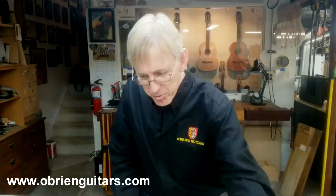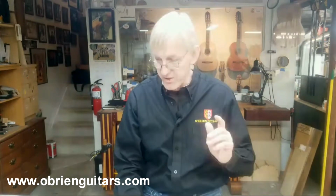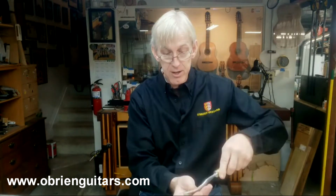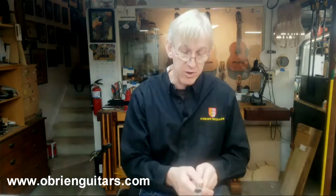So let's get back to what we were doing. I hope that answered the question on how to do the gouges. That's how I would do it. Some people do it on a grinding wheel, you know, those that are made specifically for sharpening radius tools, and come in and hit it on a strop afterwards and get it to a mirror finish. And a lot of your carvers will do that. They will just kind of skip this step and just hone it lightly and then quickly run over to a buffing wheel and do it that way. That's one way to do it. I find that it doesn't keep my tools square, and I'm a little more OCD about it, so I don't do it that way. But the carvers do that, and it works great.